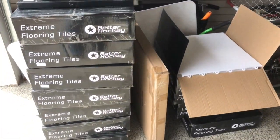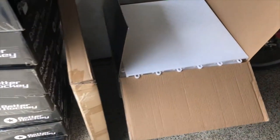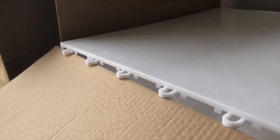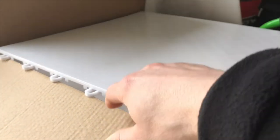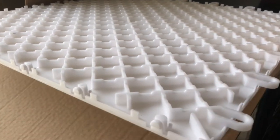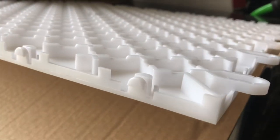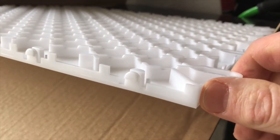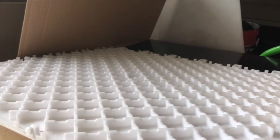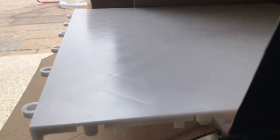The dimensions of the tiles were important to design the pad so it could fit as many tiles as possible with the space we had. In our case the tiles were 18 inches by 18 inches, and with the space we had we calculated a pad of 7 tiles wide by 14 tiles long, or roughly 220 square feet of space. I designed the pad to be a few inches wider and longer to provide space for expansion.